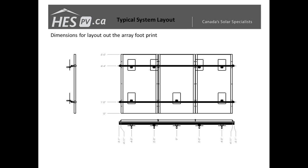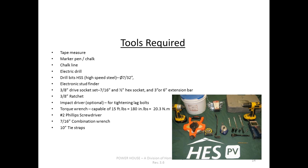We've actually laid out a W-pattern or sawtooth pattern for the mounting feet. The benefit of this is that you're landing on each truss while still reducing the number of penetrations needed on the roof. We will be making layout drawings available to installers showing distances from center to the end of the rails and end of the panels, to help you lay out your system footprint and mounting feet based on a 48-inch on-center span.